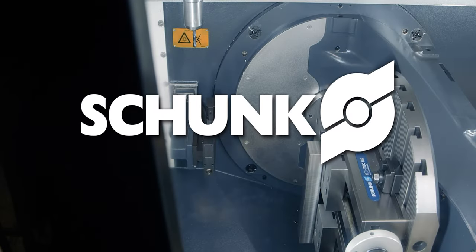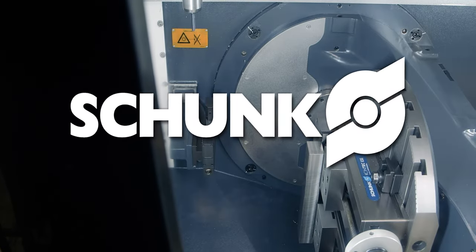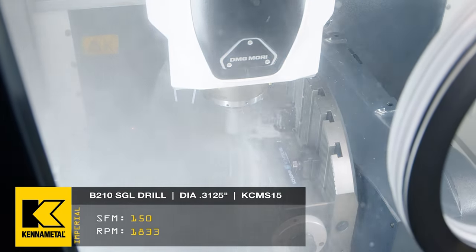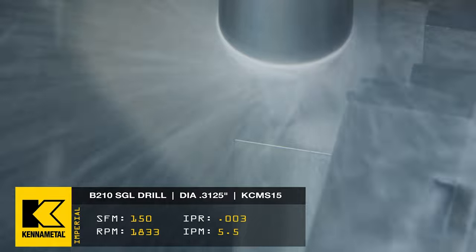All right, so just a few things before we start this deep drilling cycle. So I pre-drilled this 316 stainless with an SGL stubby drill. We went Z negative 1.2.